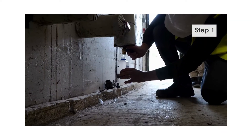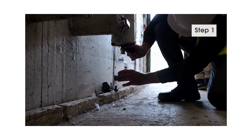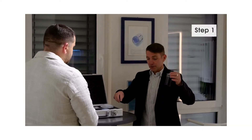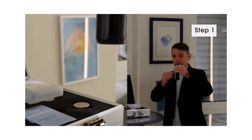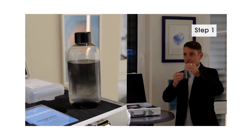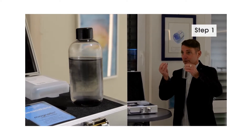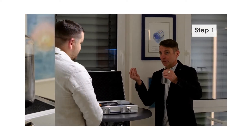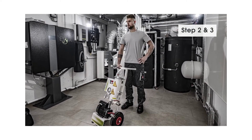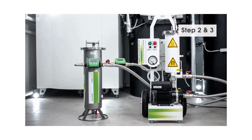You take a water sample which may look like this — when it's black, you can see this is corrosion. To make it visible, you take a magnet and you see the water becomes clean. The magnet is typically the pump in your system, which collects all the magnetized sludge and would break at one point. Steps two and three are normally done in parallel.